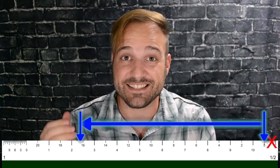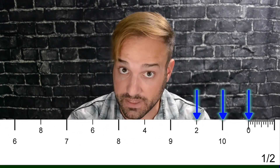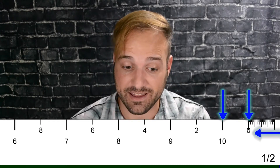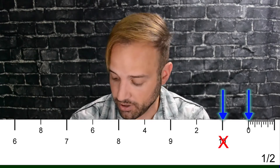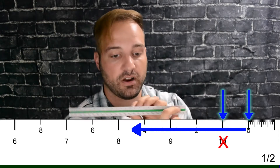If you look at the one inch and the half inch side, starting with the half inch side: whenever you are measuring a line that already exists, you are going to start at zero. We are going to ignore all the little lines to the right. You're just going to go to zero and go in towards the ruler. Look for the ascending numbers — zero, then the next number is 10, then the next number is two, then you have nine. So that line that the zero is on, notice that the 10 is a little bit lower, so that 10 is not a part of this half inch scale measurement. You've got to look in line where the numbers are.